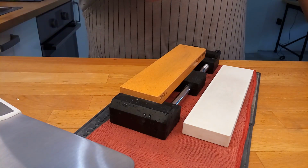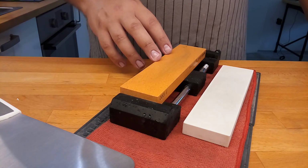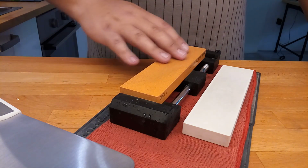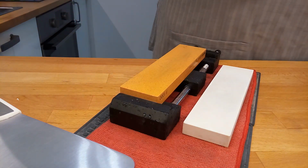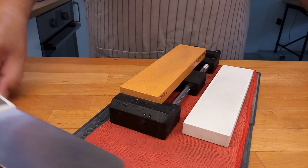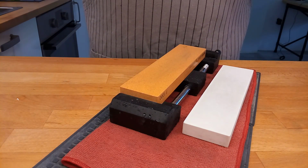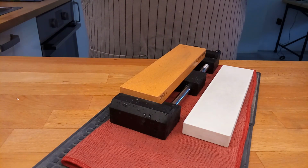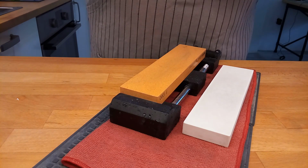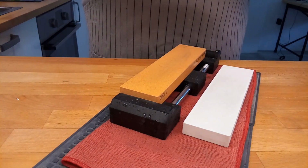you heard that there were high-pitched scratchy noises. In my opinion, that was the shoulder of the primary bevel hitting the corners, if they are not chamfered, or just is too finely finished. I'm guessing, of course; this should be observed under magnification, and I have only a 10x magnifying glass. But as I said, this 500 finish on 220 leaves a little bit rougher finish, and I cannot detect such roughness now on the shoulders, the transition between the bevel and the edge.